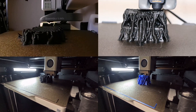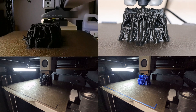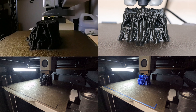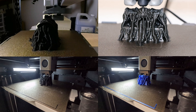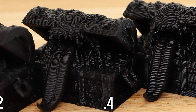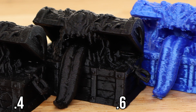To test supports and fine details, I used a mimic miniature. We'd expect the 0.2mm nozzle to be better at small details, and while it was, I didn't realize how fragile the model would be — use a little more infill, or when pulling away supports you're likely to break the model, like the tongue coming out. The 0.8mm nozzle obviously had the least amount of detail and the strongest supports since it can't under-extrude as much, but the model is also stronger and that wasn't an issue.